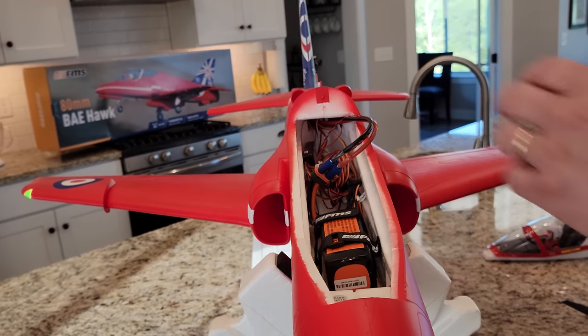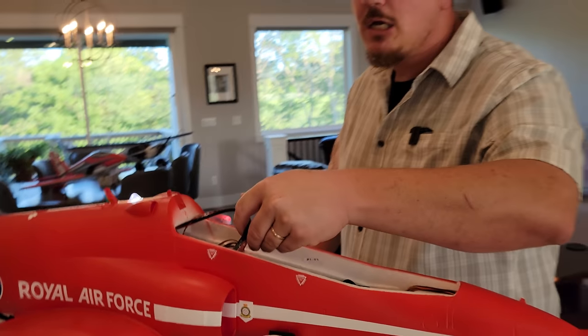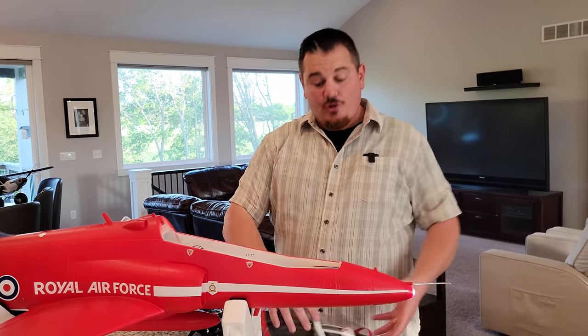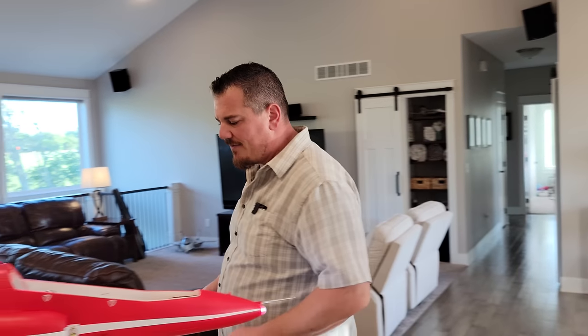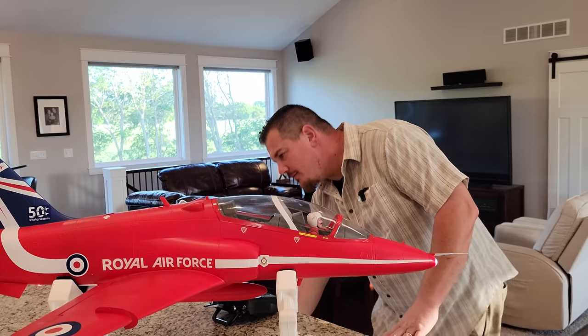That little portion that's clear, instead of being wrapped in plastic, the same dark blue or dark gray plastic, that's the portion that's actively receiving the signal, and it's 28.8 millimeters long, I believe. I think that's right. And if you were to strip back that coax cable to 32 millimeters, it's screwed all up. Yep, and it's factors of 28.8. If you were to double it, then it would work okay. It's how they fine tune that. So weird. I know. A lot of this stuff is weird.